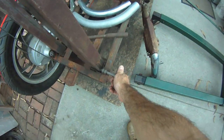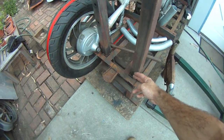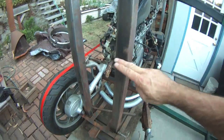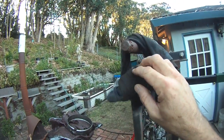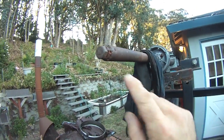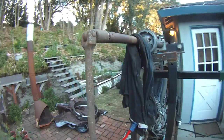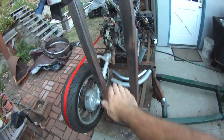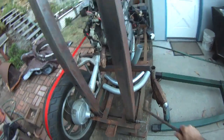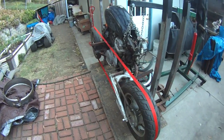And I've got thumb screws here on the back that'll be able to lock it in position. I have one on either side. Ultimately, I'm going to have a marker here that's going to delineate 1/4 inch. So you just get in here with a wrench, and of course I've covered it so I don't conk myself on the head, because I will. What you'll do is loosen those two thumb screws, and you'll come in with the breaker bar set on here, and then you'll be able to raise and lower the entire cutting assembly as, in this case, you're going to be lowering it as you're cutting more and more boards out of the log.